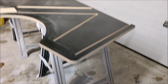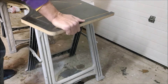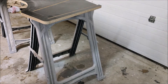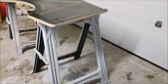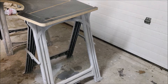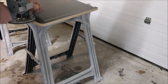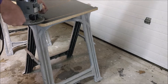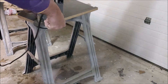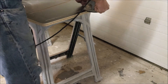The other advantage of installing T-molding first is that I'm going to be installing this with Kreg screws as opposed to staples, which is the usual practice for cabinet builders. The staples method uses hardwood blocking, glued and stapled in place. Personally, I like Kreg screws. The issue is that Kreg screws go into panels at an angle, and depending on where your edges are, there's a chance the screws may cross paths with the slot for your T-molding. So I'd much rather cut the slot first, install the T-molding, and then put the Kreg screws in afterwards.